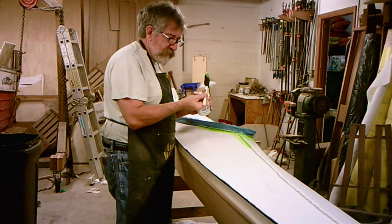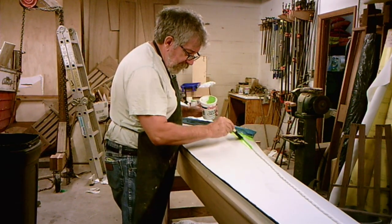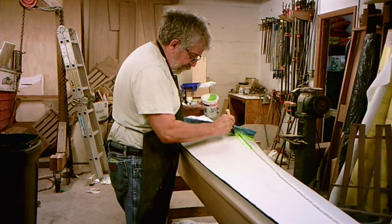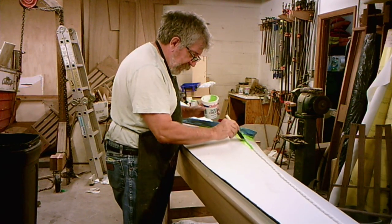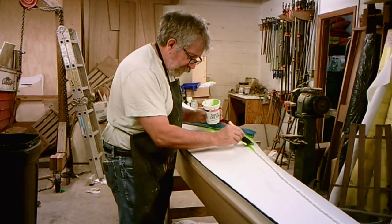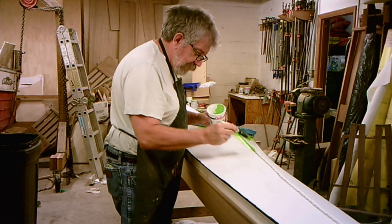And as I was saying, you've got to seal the seams. So I start down through here before I do the roller. As I brush on kind of a heavy coat, moderately heavy, and work it into those corners in there. That seam in there is a hard one to get paint on. So take that. I like this little brush.